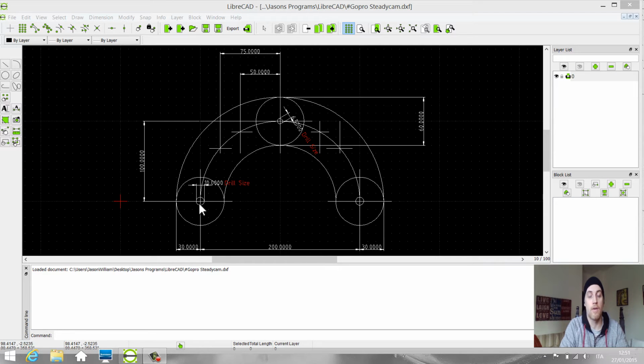The diameter of our holes where we'll be attaching our handles will be 10 millimeter diameter, which is basically because the bolts that are on the handles are 10 millimeter diameter. Okay, the width of our Steadycam is going to be 60 millimeters. The reason for that is the base of our handles are 60 millimeters. When I say handles, they're not really handles, they're called table legs actually. So I'll be showing those also a bit later when we get down in the workshop in the garage.